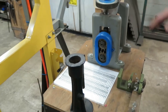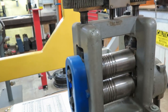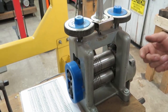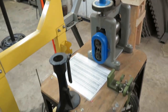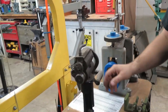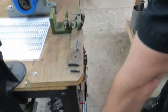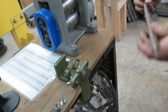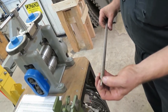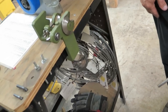Over here we've got a piece of equipment from the jewelry industry that they use to flatten or emboss stuff. We roll metal through here and make shims sometimes, flatten out wires. These are old tinsmith tools — it's actually a burring machine. We use these to fabricate certain things. This is a manual spring winder — if we need to make springs, we make these arbors out of drill rod. You don't even have to harden it. This one actually makes a tapered end on a spring and you just wind the spring wire around. We use stainless steel spring wire.